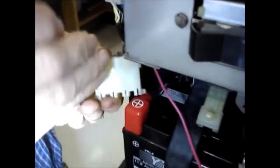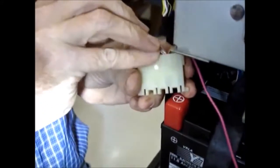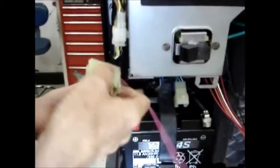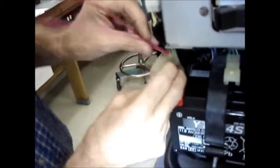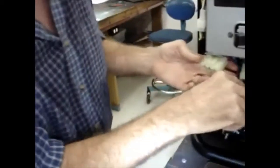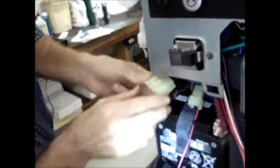And these extra fittings that we're putting in here simply allow me to take a fused 12 volt signal lead for switching, so I can turn the fuel injection computer on and off, because after testing I discovered that Honda's fuel injection computer draws a tremendous amount of power in standby mode. And the neat thing about remote controls is that you should be able to use them in standby mode. So this way we can control this generator's voracious appetite for power.